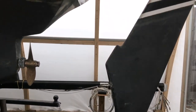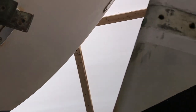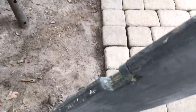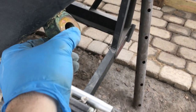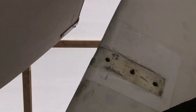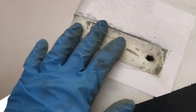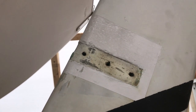That was not too bad. I had to remove the mounting pieces for the quadrant, and I've tied off the rudder head to the pushpit, supporting it with no problem. Down here at the bottom, there's my pintle, and here's the gudgeon mounted on the keel. There's a little bit of play in the rudder on this, so I'm going to see about possibly getting a bushing for that. Note that the rudder here has been recessed, because the quadrant piece is only an inch and a half while the rudder was an inch and three-quarters — that's why they must have recessed it. I'll probably just fill that in with some fiberglass or epoxy, or both.